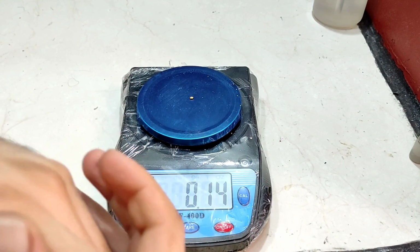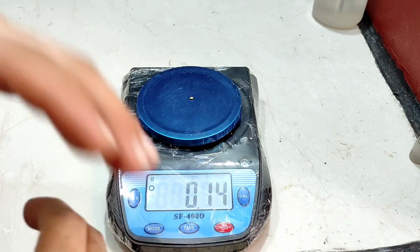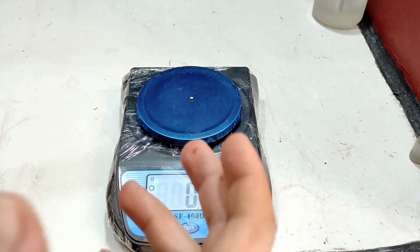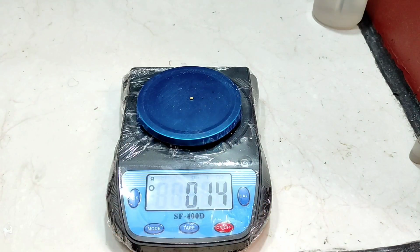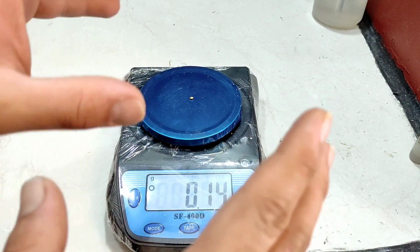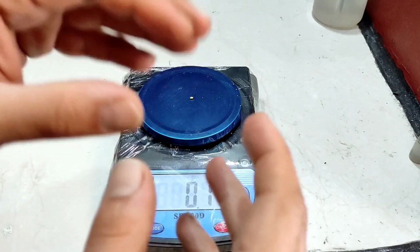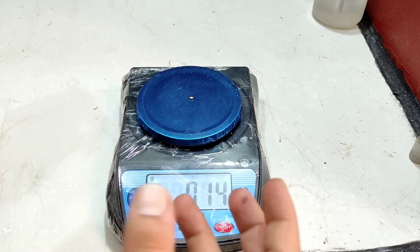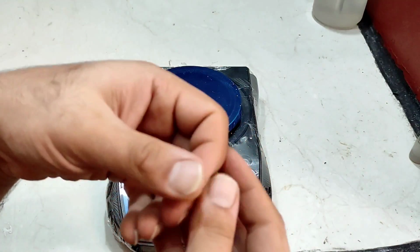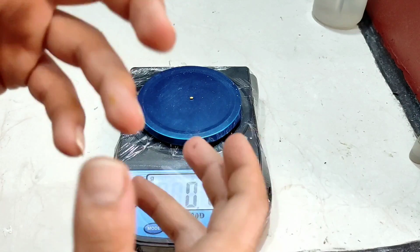In the following, I've used MBT, cyanide and metanitrobenzoic acid. Metanitrobenzoic acid was a pretty good oxidizing agent, didn't kill any cyanide, but it is kind of hard to make this chemical. So I think it is good to substitute it with hydrogen peroxide while keeping cyanide and MBT. MBT will prevent and inhibit the solution of copper and slightly reduce attacking bright nickel underneath the gold plating, but it will not prevent the solution of iron. So you shouldn't use any iron piece in the bath that you want to leach gold.